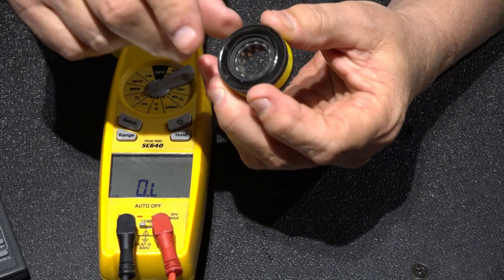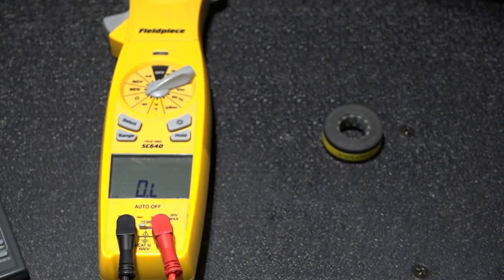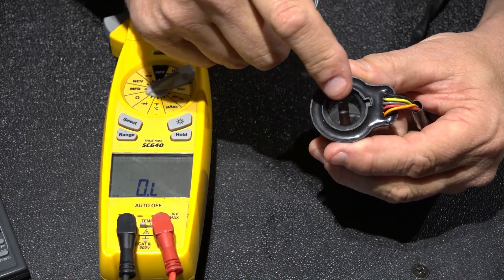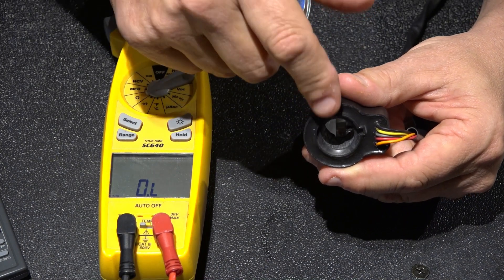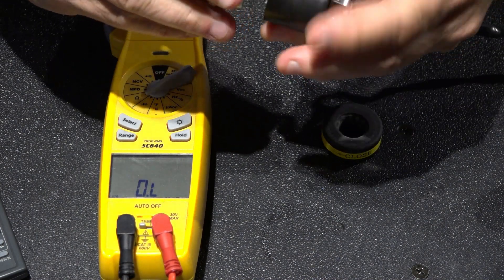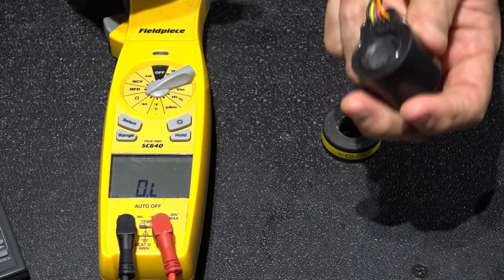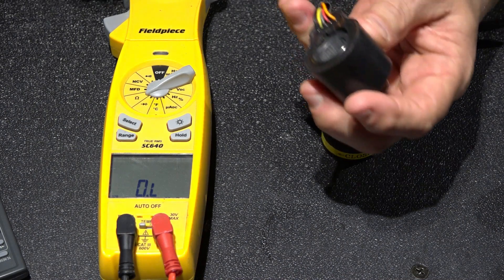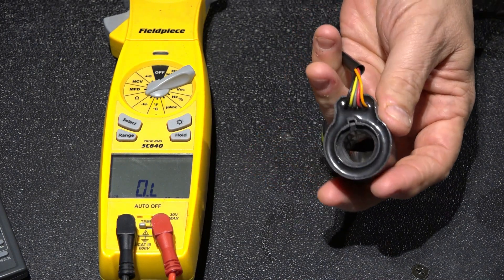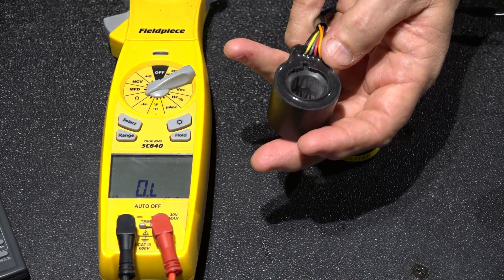Inside the power head it's going to get corroded too, because these parts have got a neodymium magnet inside and the little shiny spots inside are a steel conductor. I can take that same top post battery brush, pull the cap off, put it inside, give it a few twists, and that'll clean it all back up. In some coastal areas you're going to have to do this quite often - I've got a few systems down on the gulf coast where these have to be cleaned every six to eight weeks on their multi-port mini split to keep the system operational.